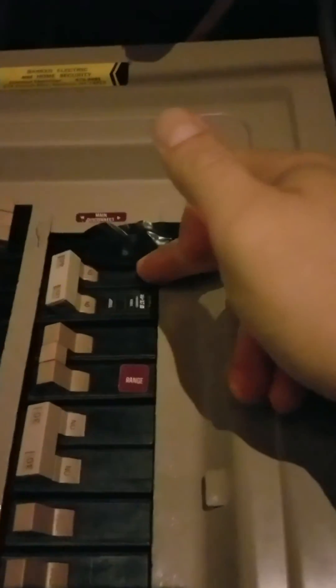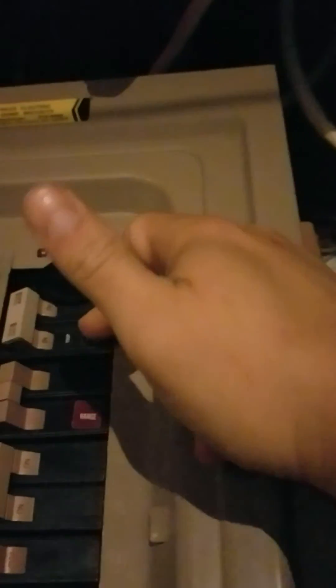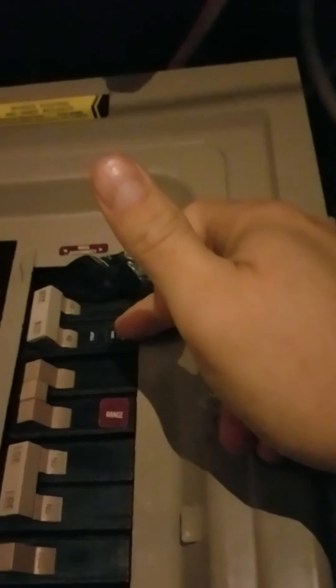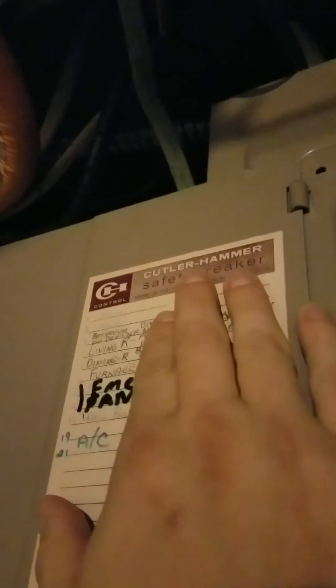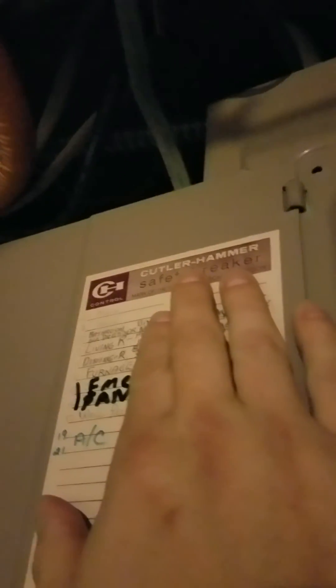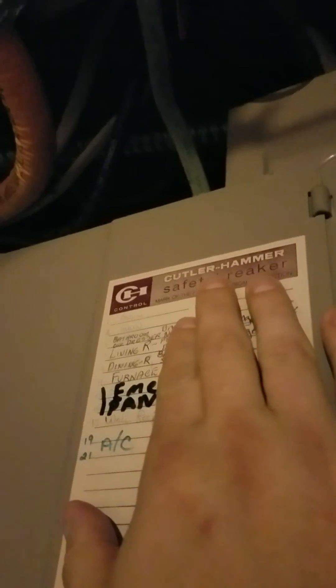We did a hole punch in the bottom of the box. Again, this is a four-strand cable, and what we did is we got a 40-amp breaker. Your red wire goes to one terminal and your black wire goes to the other — that's for a 240 dual-gang breaker. You've got to make sure when you get this 40-amp breaker that it matches the type of panel you have. In this case it's a Cutler-Hammer — there are so many different kinds — just make sure it matches up with your panel when you go to the store.